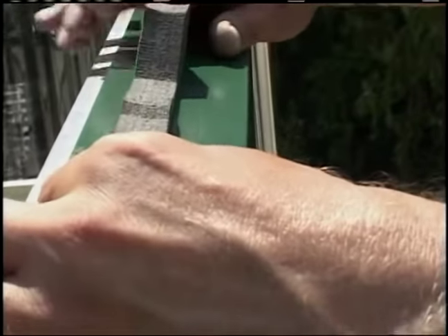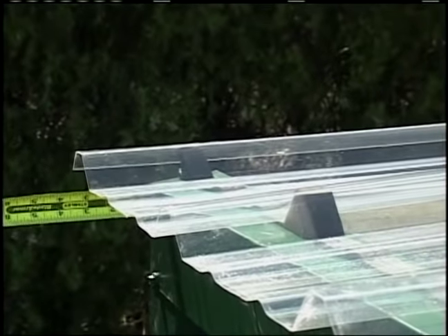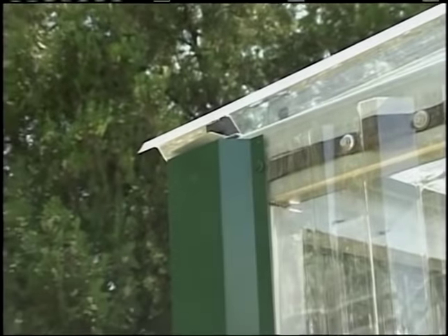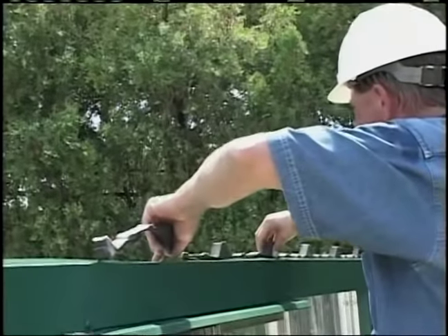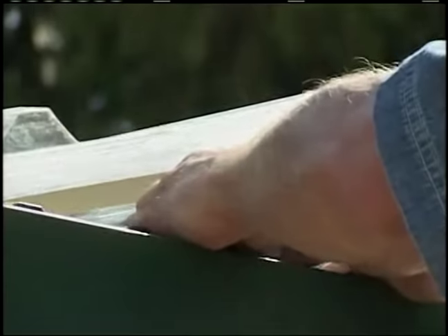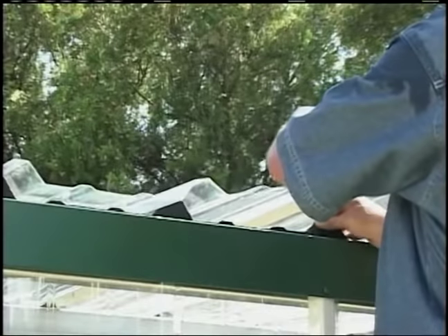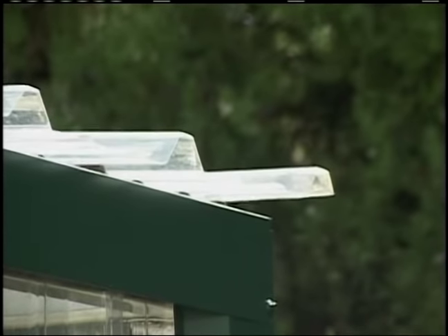Use these visual reference marks to keep the closures centered properly. Then place the rolled roof sheet assembly on top of the roof purlins, align and square the assembly, and verify the overhang before securing the sheets with the appropriate screws. The second method is the typical one sheet at a time. It's recommended that both sides of the roof be sheeted simultaneously, checking for proper alignment as the sheeting progresses. Prepare the roof by placing the closure strips as previously explained. Once the eave is prepared, the first roof panel may be installed. Check the erection drawings to determine the roof overhang at the eave. Set the roof panel in place over the inside closure, ensuring the major ribs of the panel nest properly with the inside closure.